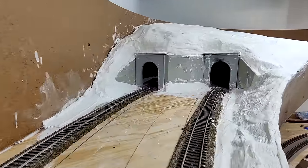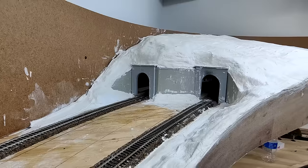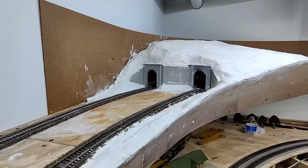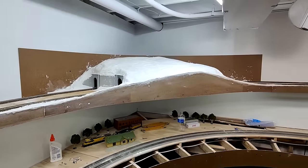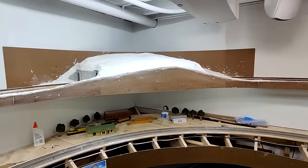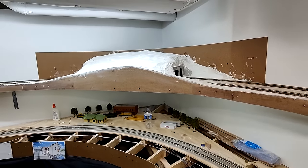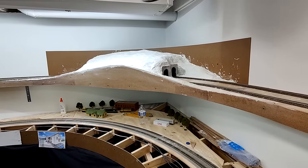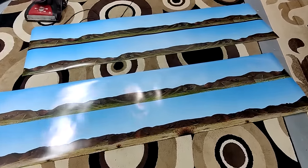But once you take your brush and put the thin plaster onto the existing plaster, the existing plaster just kind of sucks the moisture out of it. And so it kind of instantly turns thick as you paint it on. So it starts off thin as you're painting it on, it thickens up and you're able to cover up cracks and smooth things out.